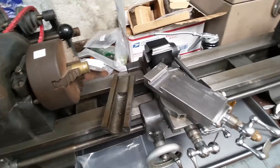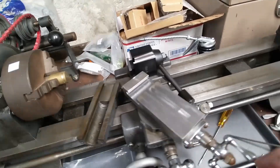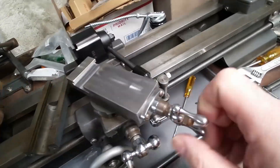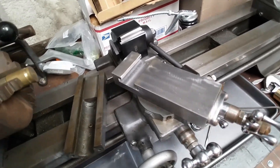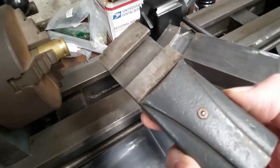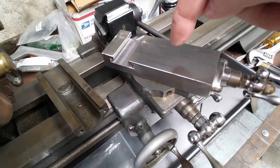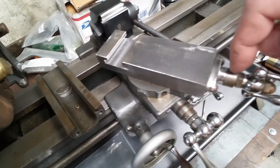Good news, bad news. Good news is this fit on there, and I was able to get this off with the little slanted pins. All the stuff went back in. It seems snug in this direction, so I got the movable gib set right, so that part's good. I still have to figure out about putting — I have a replacement oil button coming; it should be here Tuesday, this is Sunday. So then I can measure and drill and put that in there, so that way it will be able to oil this screw that goes in there.